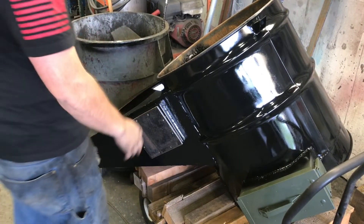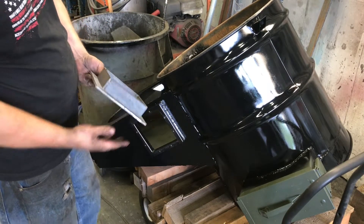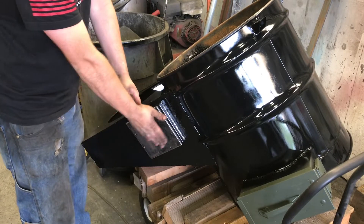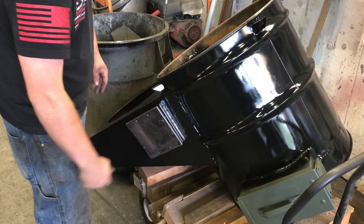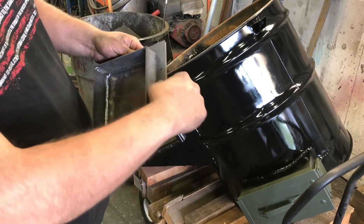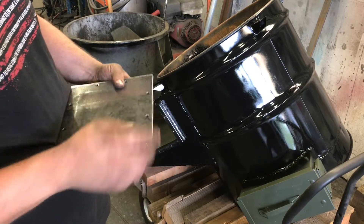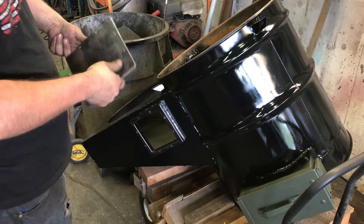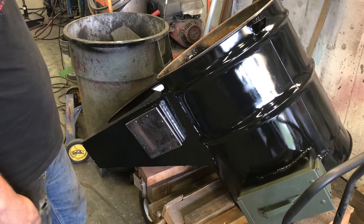In the interest of protecting the gasket for this plate, I added some 1/8-inch walls just to the inside so it still slips in. It'll also help me guide it into place around the cross member while I'm getting bolts started. Then I went ahead and just cut out a square gasket, laid it on a board, ran the drill bit through — tried to get the cleanest holes I could in the gasket. Sometimes it works, sometimes it doesn't. That's ready to be painted and bolted on.